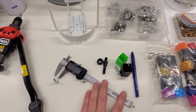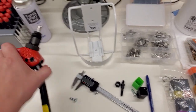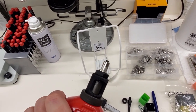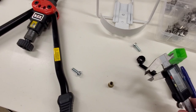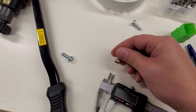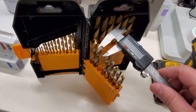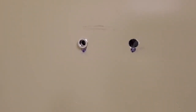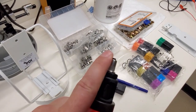So how do we install these and how does this little contraption work? I've got my fastener here — I actually have one installed on the tool. It just screws on all the way up flush to the jam nut. So the first step is measuring the diameter of the riv nut. Once you find the diameter, then I go to my drill index and find the correct drill bit. We then drill the hole in the material where we need it placed. The riv nut gets screwed onto the correct thread pitch mandrel.